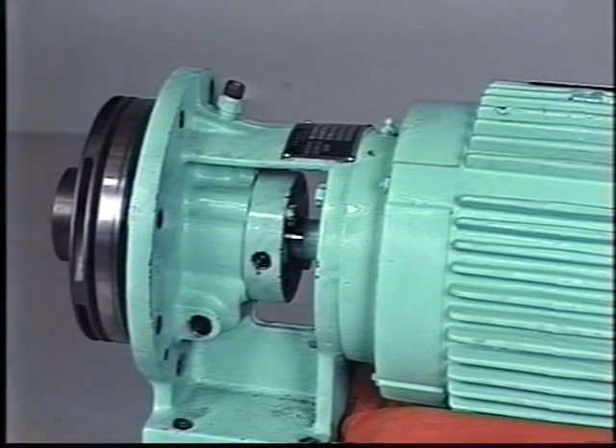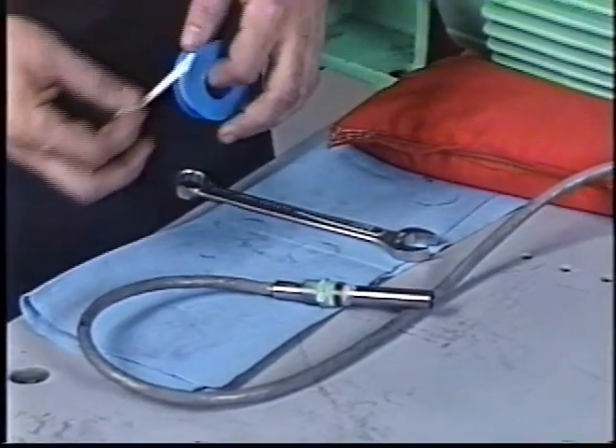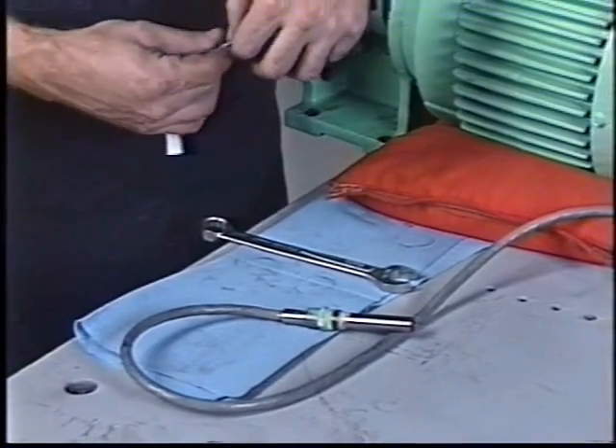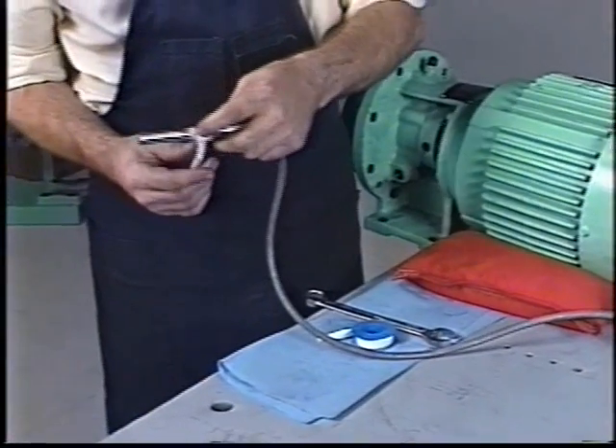Make sure that the oil port on the gland is in the proper orientation before pulling the gland up to the seal chamber face. This should be on the right hand side when facing towards the motor. Using both hands, pull the gland up against the seal chamber face and start two diagonally opposite bolts. Do not relax pressure against the gland until at least two bolts are finger tight against it. If the gland is moved back towards the motor face after the outboard stationary seat and outboard primary ring may contact, the outboard primary ring may be pulled out of its retainer. Once the two gland bolts are tightened, the remaining gland bracket or back plate bolts may be installed and tightened. Reinstall the heater. A small amount of Teflon tape or suitable sealant should be used on the heater threads.